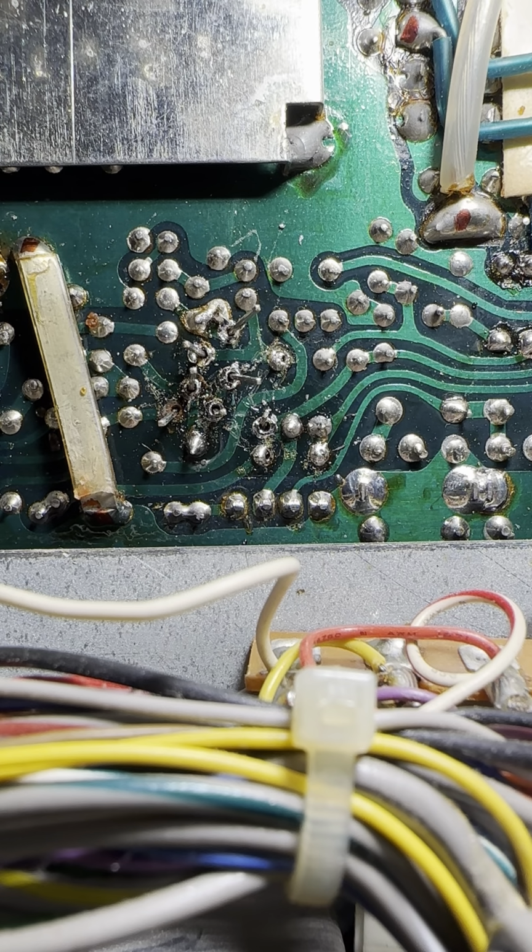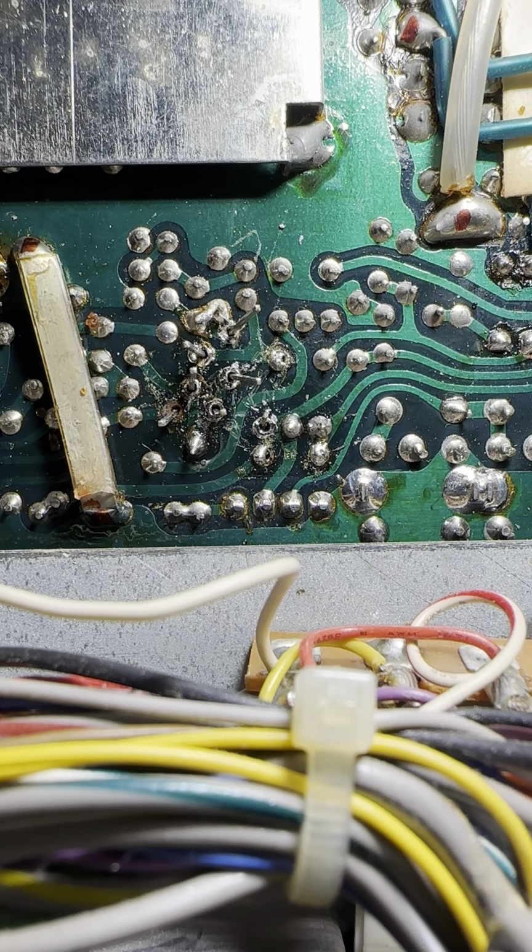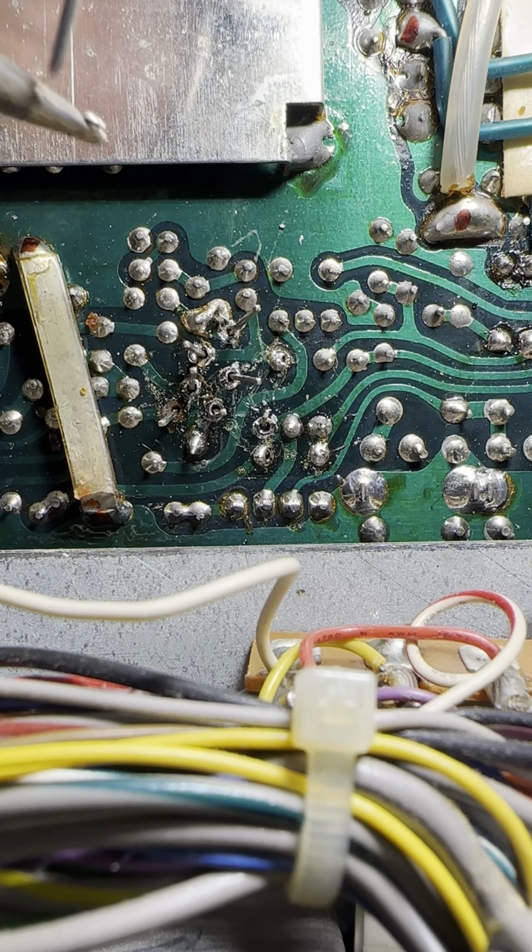Of course, the soldering iron won't work because the tip is dirty or something. Rub it on paper. Try it again. Yeah, and the ground comes off, of course, because it's not proper. We're regrounded. Tin the tip. Tinned. Now carefully not bump this damn thing.